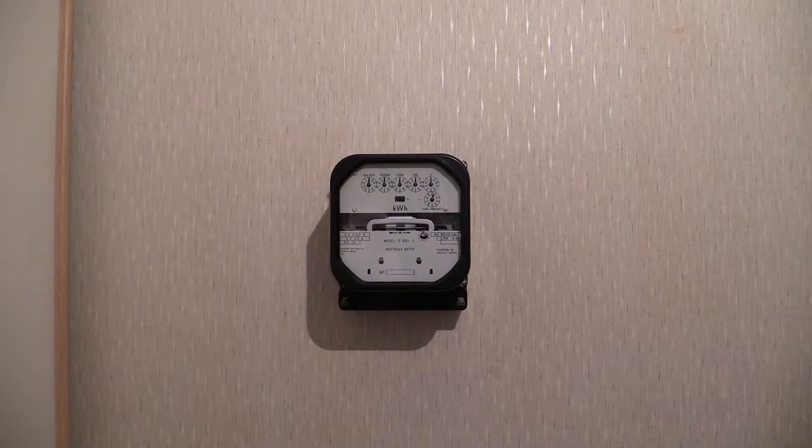In this video we're going to be upsizing a bit to the industrial size. What we're looking at is the Sangamo Western S301.1. This is a three phase four wire instrument — three times 240 volts, three times 50 amps, 50 Hertz alternating frequency. Three phase four wire, and the load wheel speed on this one is 40 revs per kilowatt hour.